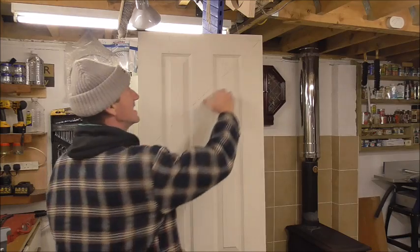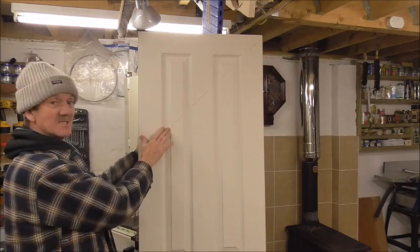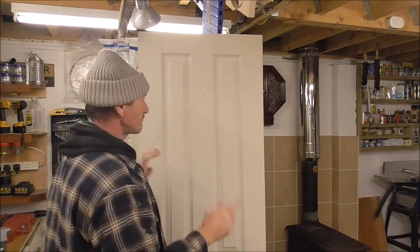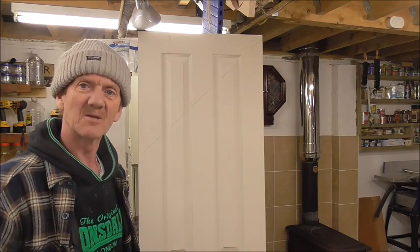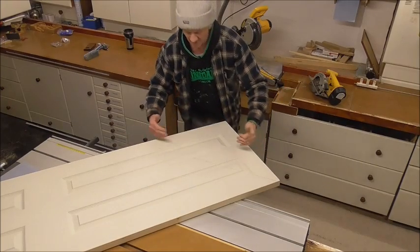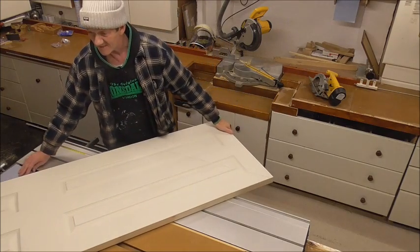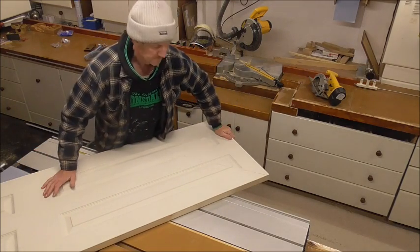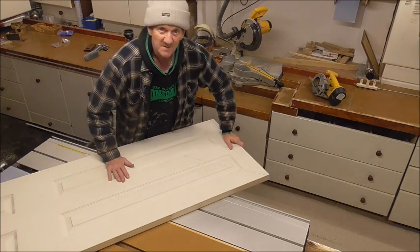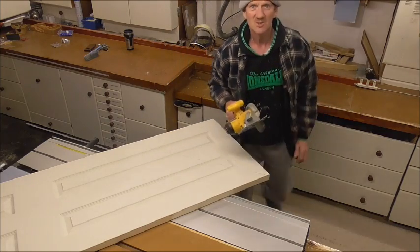Like with the standard adjustment, we're going to cut the line and then put an infill. Only trouble is this time the infill is not just a square piece - it's got to have that shape. Not too difficult. Follow along and I'll show you how I'm doing it. When making this cut you've got the option to set up the saw table and cut it that way following a carefully laid out jig, which would take some time, or you can do it by hand with a hand power saw - that's the quickest. So that's what I'm going to do.